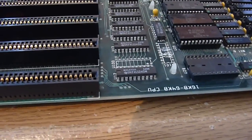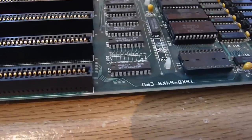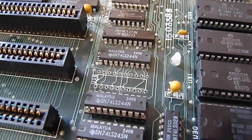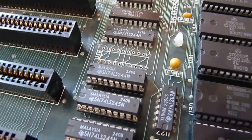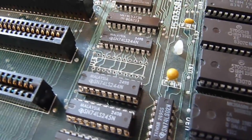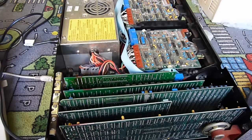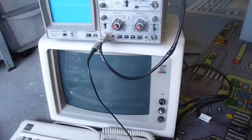Why is the solution always spend more money? No busted traces, however. I've socketed all the chips I've removed and I think it might be time to play musical chairs with some known-working chips and see what that does. This is looking like a new motherboard situation.